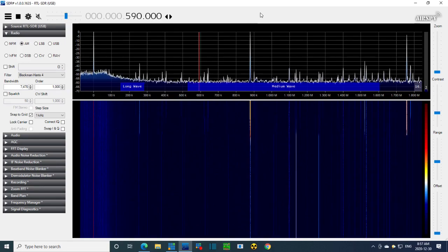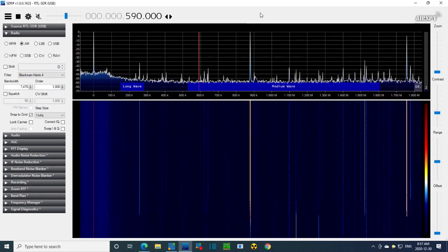So now you see three new signals and some existing ones have gotten weak. I see another one. Four signals have shown up. So there's two there that appear orange. One at just below 900 and one at double that, just below 1800. That's the primary oscillations. What these other things are, I don't know. And plus, the oscillation is strong enough that the SDR's own AVC cut back the received signal level of all those other weird things, whatever they are.